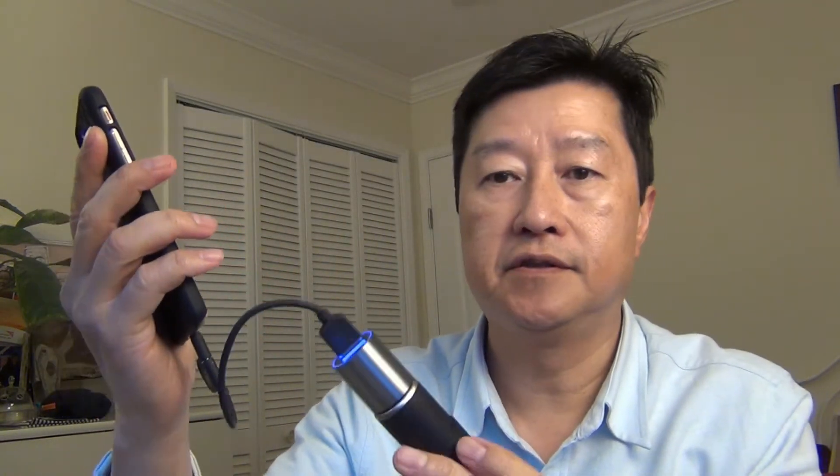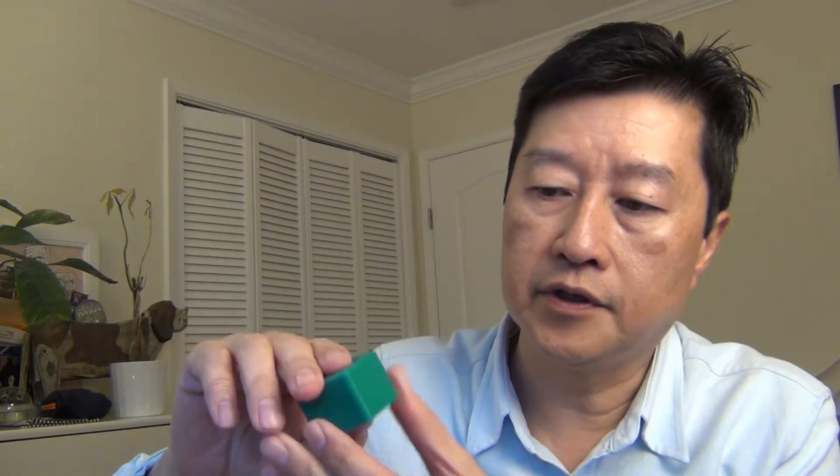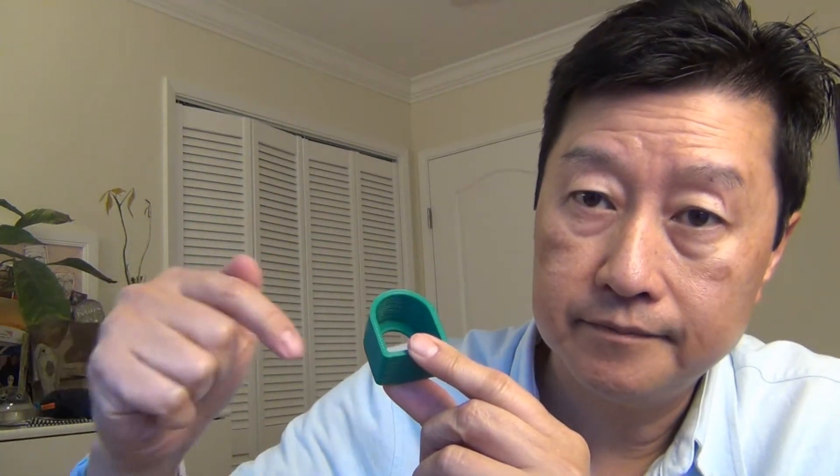Very simple device. I'm going to show you how I made it. I basically printed a bunch of these using a 3D printer — this power clip design by Siffer Gregg. What you need to do is put the wire into this thing, string a wire into it, and in the middle there's a little clip here, a little bump. You wrap it around that bump, and it acts as some kind of springy device.